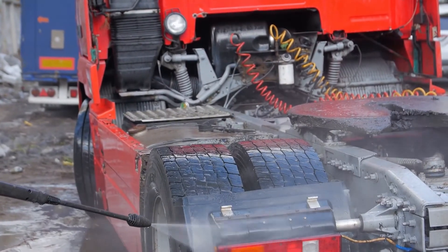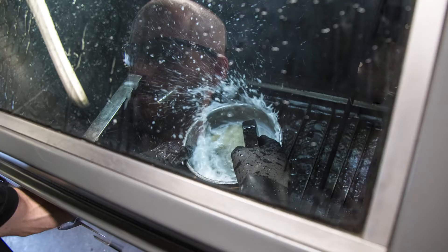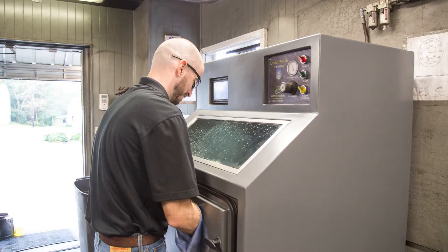Obviously there's a level of automation to it — it's not just a guy with a pressure washer. Is it straight water, or is there a solvent for those different kinds of particulates in the filter? So it goes both ways. There are some machines that are fully automated and require a solvent to be added to the filter before the aqueous process starts. Then there are machines like ours that are just pressurized water — a manual cleaning with no solvents. It's inside a big sealed cabinet, and the water has to be treated after going through the filter to remove the soot and particulate matter before disposal.